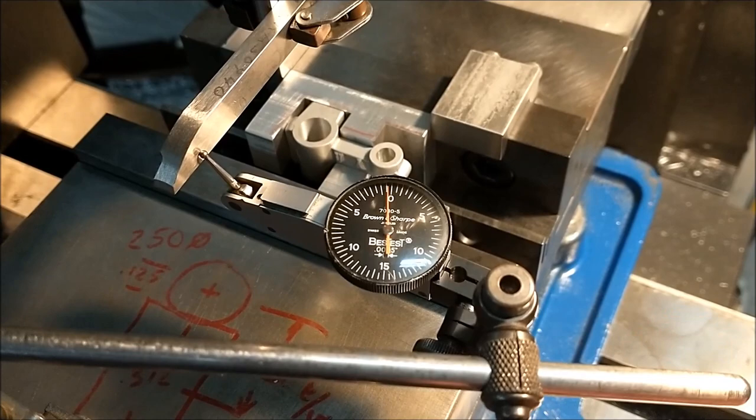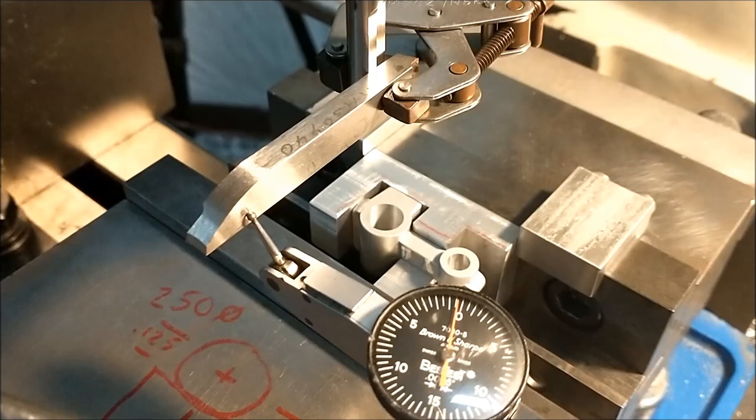All right, let's recenter it over that particular hole right there. Preset on the digital so I don't have to sweep the hole and ruin the indication of the broach. Put that slot in.